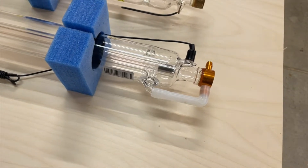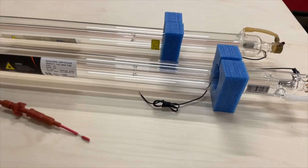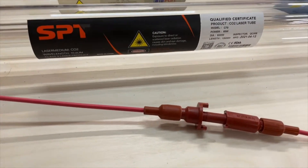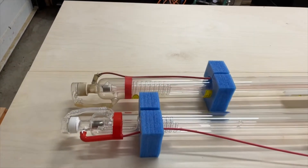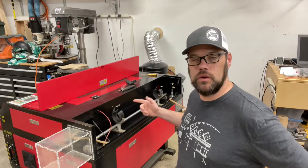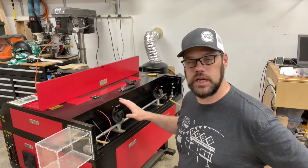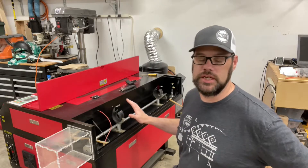So you can see there are just some added bonuses when you pay for a quality tube such as the SPT C70, as this would be a drop-in replacement for my older 60-watt CO2 tube. Now that we've got the old tube out, we're going to go through how to replace it with the stock similar-size, similar-length tube, reusing as much of what's in the machine as possible.